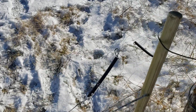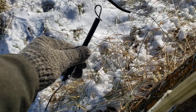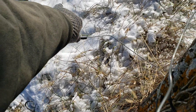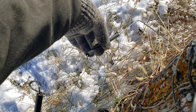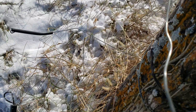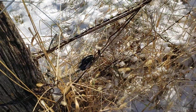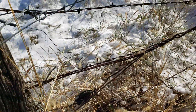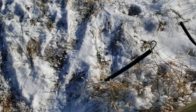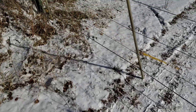And then this is kind of important right here. So you've got an insulator tube on that, and that's going to hook into — I can't hook it because I don't have anybody to take my video — but those two are going to hook together. I've got a little hook on that, you can see that. So when you want to open the gate, you hook the electricity off of it. That just comes off our electric fence. We wrapped the wire around there, left the tail long, slid that insulator tube on it, put a little hook in it. It hooks together and electrifies this gate.